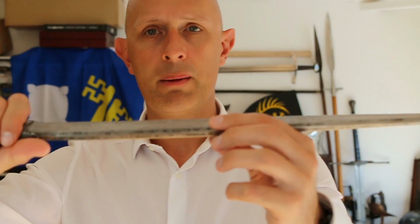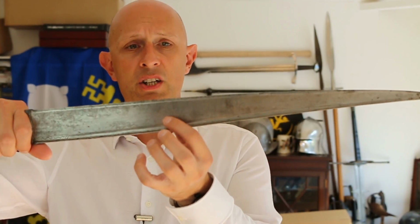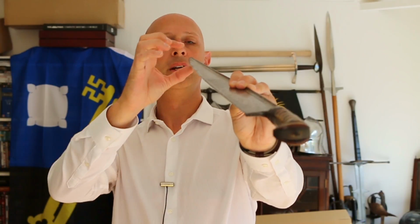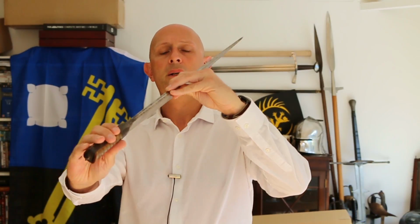Okay, right, so the Khyber knife anyway has, as you'll see, a broad T-section blade at the back, and then a thin, essentially quite flat blade. In fact, it is a wedge section. If I look down from the point, it is in fact a wedge section, but it's a very flat wedge section, so it's almost a flat blade with a T section at the back, so a T-like girder essentially.